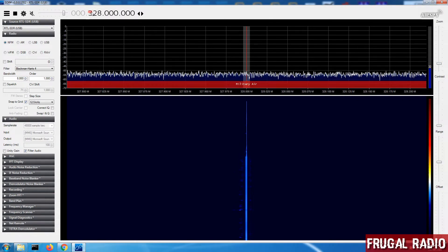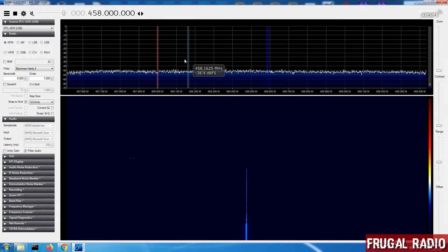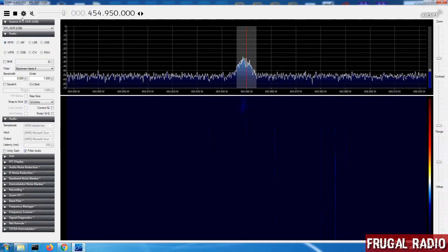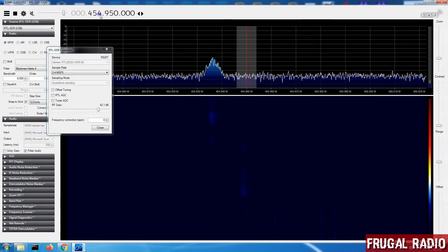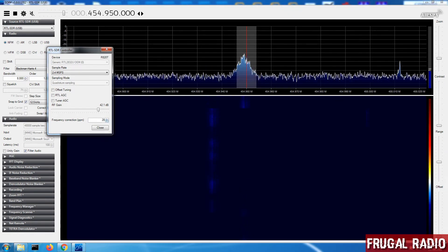If we go up into the 400 MHz band we're going to find some DMR control channels. I'll zoom out a little bit so we can spot one and go down to around 451. We're seeing a bunch of signals here — let's see if this one is a control channel. That's a control channel on 454.95 MHz, so we could use that equally to tune in. Now, remember when we first had the dongle it was set to zero — look how far out that is. But I know this DMR signal on 454.95 is needing to be tuned in. We said it was about 28 PPM, and that puts us there. To get exactly in the center of the signal we might alter it a little more.